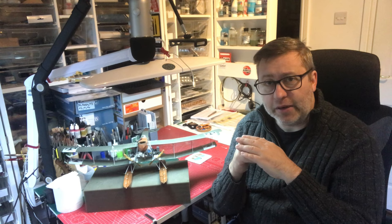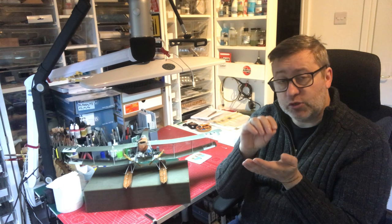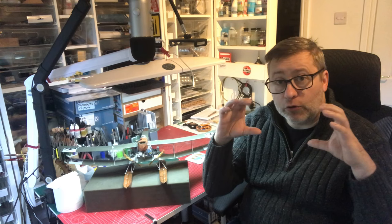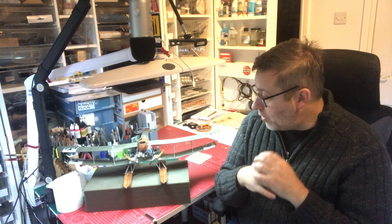Plus, some of the fit is not as positive as you'd like it to be in the lower wings. And if you're not careful, the struts can sit too low. It's possible to push them down further than they're intended, which means that the struts underneath won't go in properly. I had that problem also. It's difficult to notice when you're building struts and what they marry into isn't there yet. Very, very difficult.